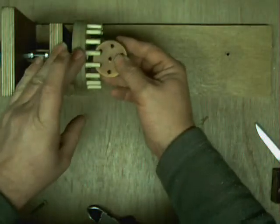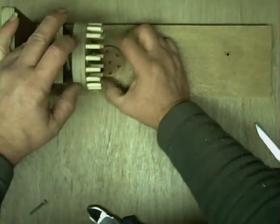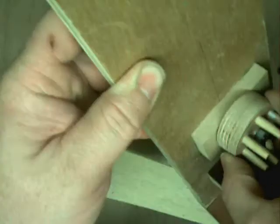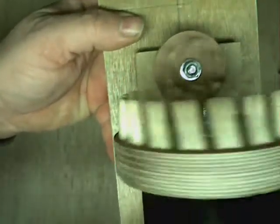That's my other cogs done — or should be done — for in there. I'll stick the dowels in now just to show you the cogs. The noise you can hear, a lot of it is actually the jumping of the cogs. I'll just knock that up just to show you. Very little effort required to make it go — very, very little effort, as you would expect. Three to one ratio: that goes round one, that goes round three.